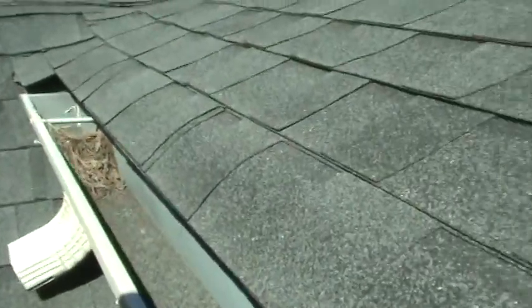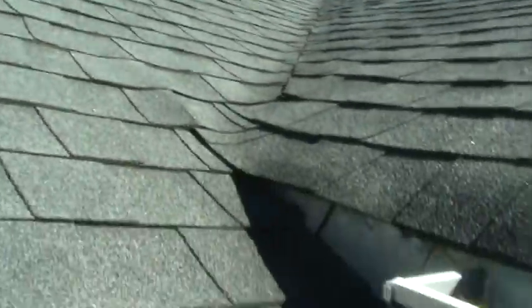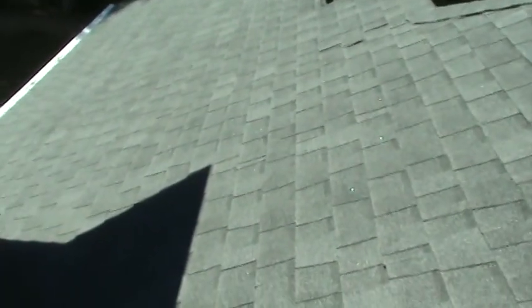And you see what the Einstein solution has been? You can kind of see some sealant down this valley. My guess is that these valleys aren't flashed at all. And you'll see as we go up on these roofs around through here, somebody came through here, some whiz kid or some handyman or whoever, maybe even the builder, I don't know, came through here and sealed these things. That's a temporary fix. But look at what's happening, and I'll show you as I get further up the roof.